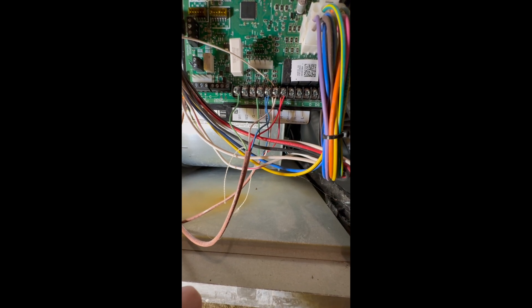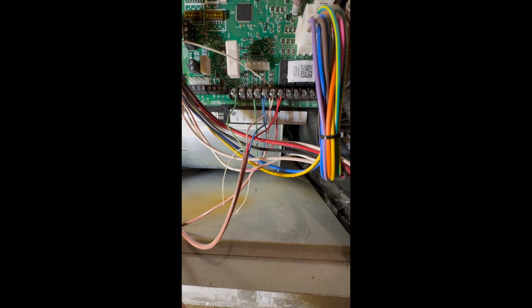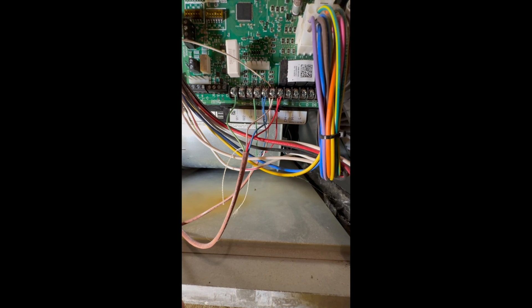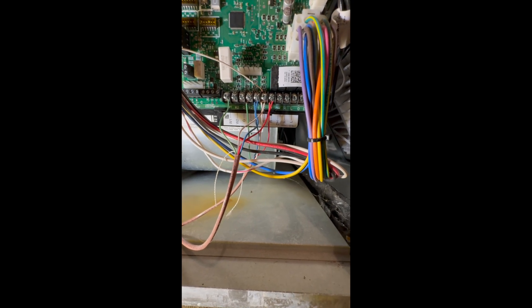But I had to find out how to get heating to work, so I did a little more research. Found out that W1 and W2 are for heating, Y1 and Y2 are for cooling, and G is for the fan. C is the common — that would usually carry regular current up to the thermostat to give it a little bit of charge, so that if we lose power throughout the house, or the thermostat itself loses power, it would still have a little charge left. Not super important, but I guess we have it, so I'll use it.